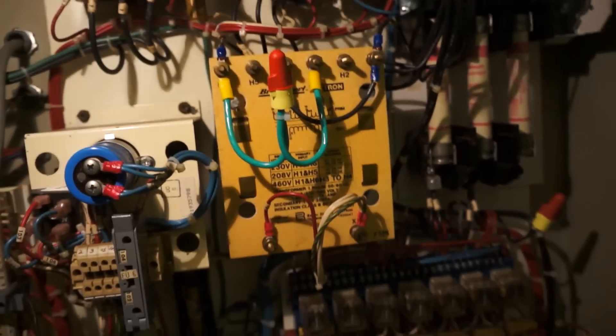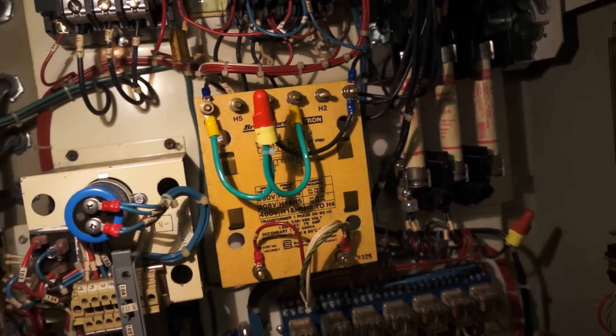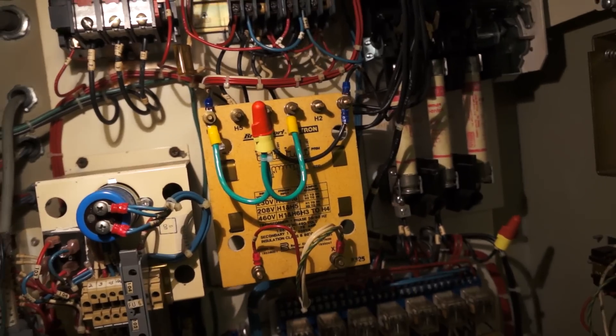Oh wow, I just pulled it in manually — I didn't know I could do that. Great giant relay of giant-tude. We just have lots of interconnects. This is for some of the lubricant stuff. This contactor up here is the spindle contactor. That transformer there actually runs all the 120-volt electronics on here. You can see my slightly terrifying patch because I didn't have any spade terminals. These bolts up here have 240 volts on them — I guess you're not supposed to have the cabinet open.